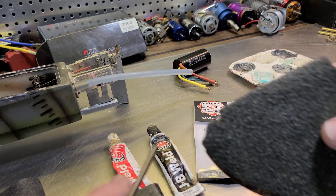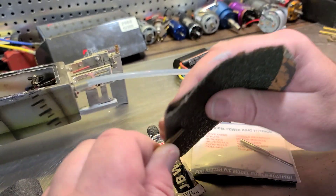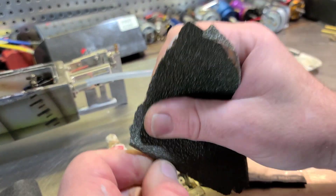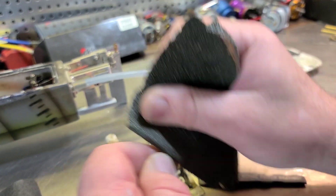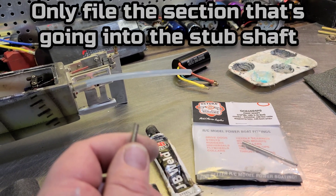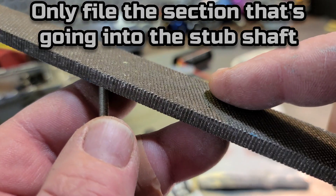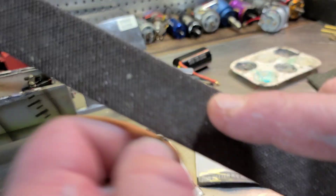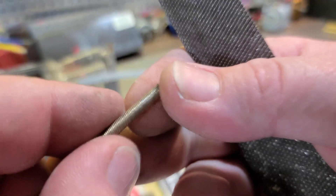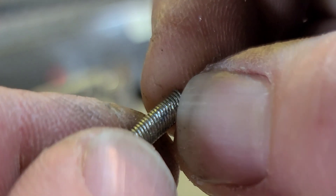The biggest part is prepping it up. I'm going to use some sandpaper — this is like 80-grit coarse. I'm gonna do the 80 on my flex cable, just rough it up real good. Go this way and then go the opposite way. You can also use a file — files work really good. I've got this really coarse file, like a bastard file, very coarse. Just gonna rough it up real nice, get some little indentions in there so the JB Weld will sit down in it.